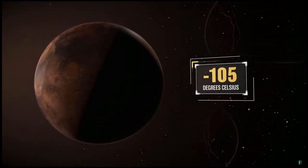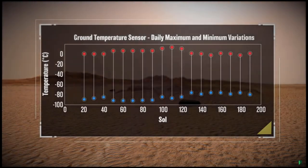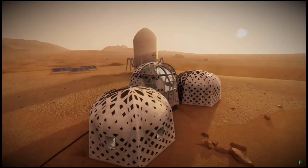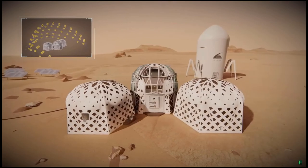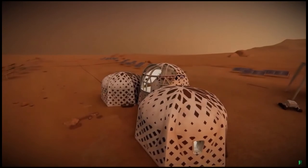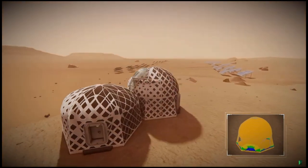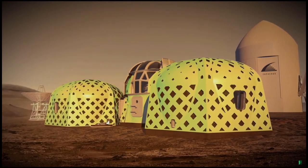Because Mars experiences tremendous daily temperature swings, thermal cycling causes concrete to expand and contract, which ultimately leads to fractures in the concrete. To mitigate cracking, the outer surface of the habitat includes a solar-oriented HDPE shading system that shields portions of the concrete shell exposed to the longest duration of direct sunlight, significantly reducing the magnitude of thermal stress while minimizing material use. Additionally, the reflective shading layer is integrated into the thermoplastic reinforcement.